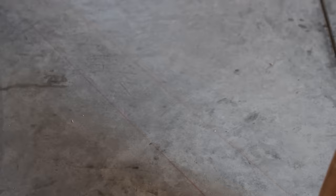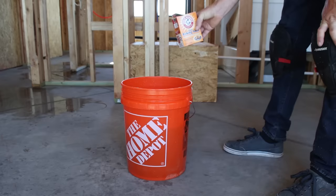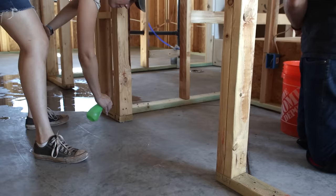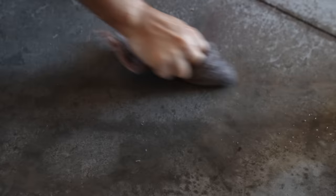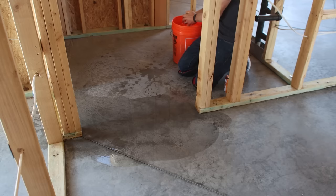Bryce and I did lots of research about removing stains from concrete, and after doing a couple of sample patches in closets, we decided to use the potentially risky technique of a mild acid to remove the chalk stains. We filled buckets with clean water and added a little baking soda — an alkaline — so the acid would be neutralized when we cleaned it up. We used a small spray bottle to apply diluted white vinegar on the chalk lines; a second person would immediately scrub the stain, then wash with the baking soda water. This technique worked really well and completely removed almost all of the chalk lines, with only one or two faded stubborn spots remaining.